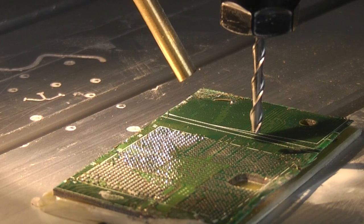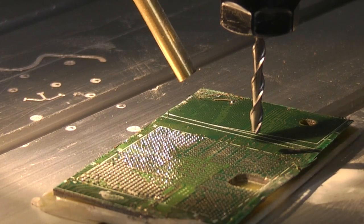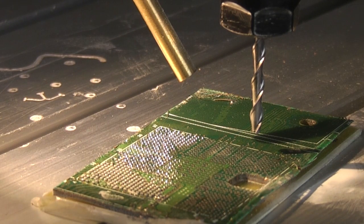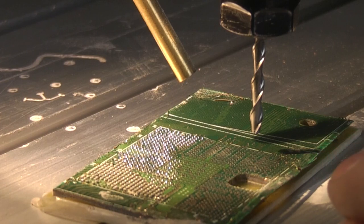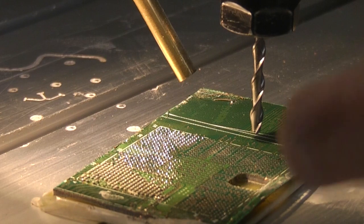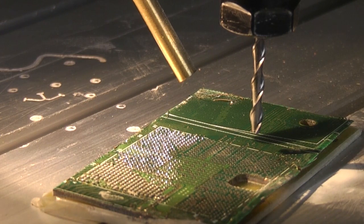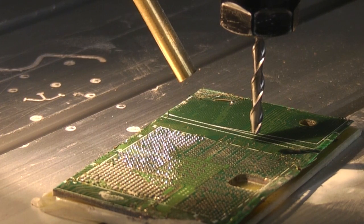This could be fed directly to the camera trigger, and it worked, but there were two problems. Firstly, I was occasionally getting additional direction pulses - I think possibly rounding errors or some permutation where it would generate multiple direction pulses. The direction pulse doesn't matter when it's not actually stepping, so it may be something to do with the firmware in the TNT controller. Another problem was that with the Canon camera, if that shutter contact is closed it doesn't produce the preview image until the contact opens - you close it, it takes the photo, but it waits until the contact is released before showing the preview. You can get around that by using capacitors to control the pulse width, but that was all a bit of a mess.